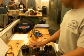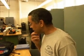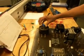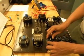The definition of jogging, according to NEMA, is the quickly repeating closure of a circuit to start a motor from a resting position for the purpose of accomplishing small movements of the driven machine. Today the driven machine is going to be an AC/DC universal motor, and we're going to use this start-stop station and this selector switch.